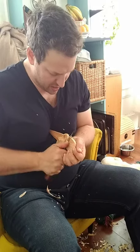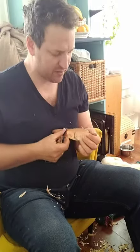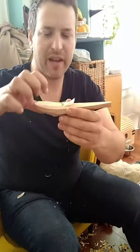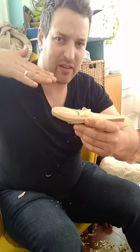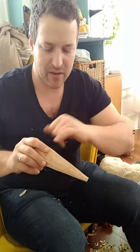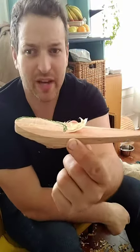And here's where understanding how you want the side rail of the spoon to be is important, because what I think is really valuable to think about is, instead of doing a spoon where the crank happens somewhere down in here and you end up pushing it up from that point, thinking about the crank as happening right in here, and then having the bowl be at one angle and the handle be at another angle, allows you to make a sweet curve in here that then dips down lower. So the lowest point of this curve on the side is actually right back where the neck on the spoon would be.